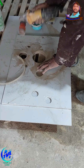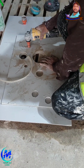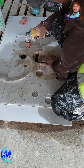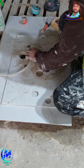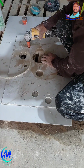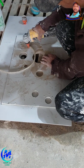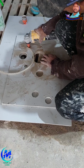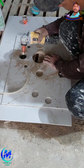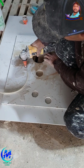Point 3. Navigating obstacles. Use smart tricks. Bathrooms are full of obstacles: drains, pipes, toilet bases, and more. Here's how to handle them. Create cardboard templates to match the shape of difficult areas before transferring to tile. Try to place full tiles in visible areas and cut pieces behind or beside fixtures. For cutting round holes like for pipes, use a diamond hole saw or tile coring bit.